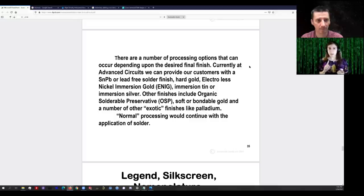You might ask: why can't we just put gold immersion directly on copper? It would work because gold has a higher redox potential than copper, and for a few hours or days it might be almost the same. But what starts to happen — unique to copper and gold, not to gold and nickel — is that copper and gold have a tendency to migrate into each other. So instead of a nice thin layer of gold on your copper, within not a long period of time it will start to oxidize and you will no longer have just gold — you'll have copper oxide on the surface. Nickel is what they call a barrier layer — this concept of barrier layers is common in plating of various surfaces, not just circuit boards.